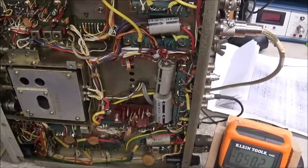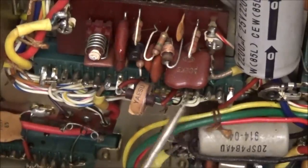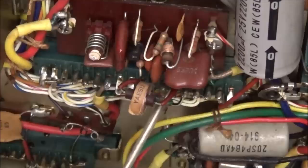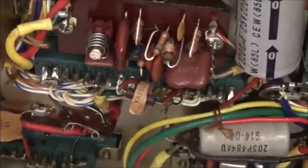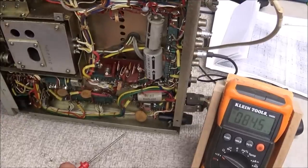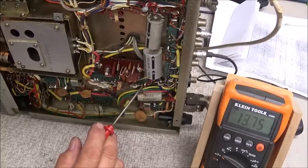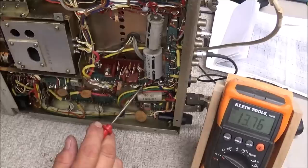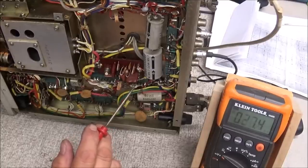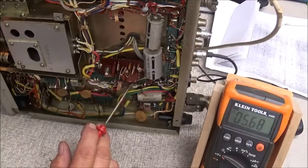As far as checking the power supply rails, we'll look right down here on this connector, looking for pin 17 and pin 14. Pin 14 is our 6 volt rail, pin 17 is our 13.8 volt rail. We'll power the unit up — that's 13.75 volts; y'all can see that in the meter. And pin 14 is running about 5.68, a little low. It's probably in need of some capacitor replacements, but it's well within working tolerance of this radio.